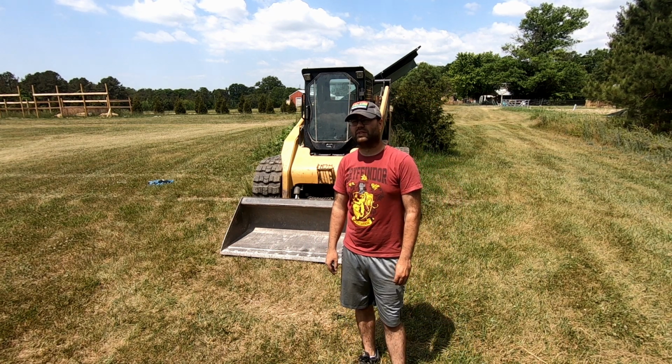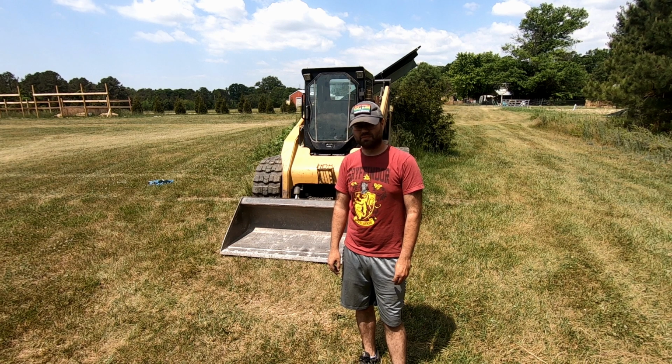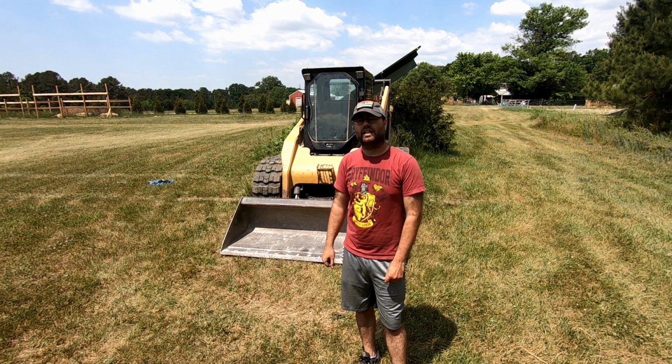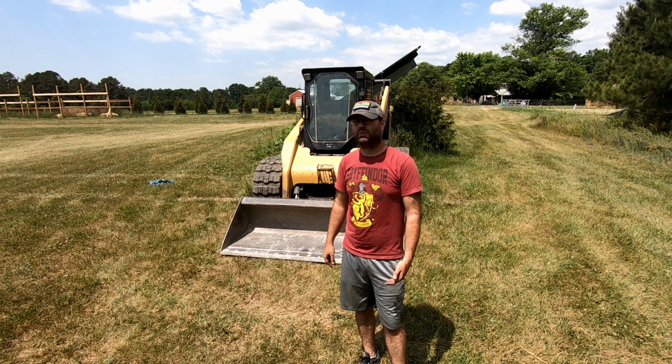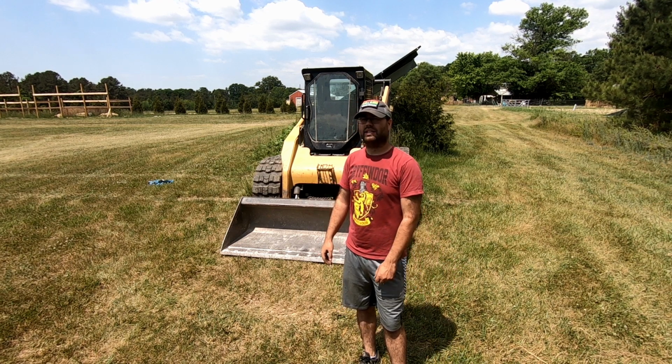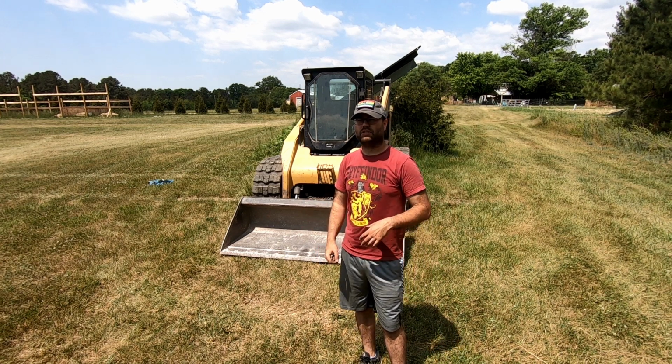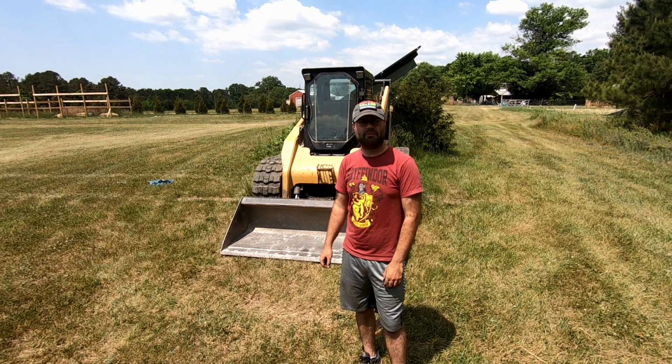We've had these tracks for probably 2 years now, hundreds and hundreds of hours on them. They're still holding up fine, but this is how you install them. Normally we install with two people, it's much easier. You just have someone hold that back strap as you're driving forward, as opposed to trying to hook it onto something, but it can be done with one person.